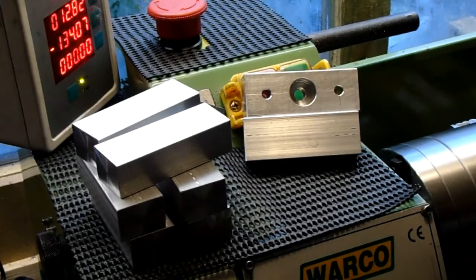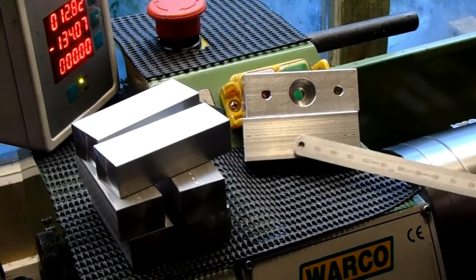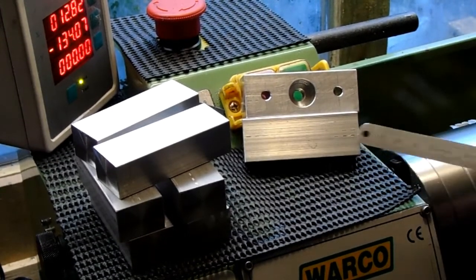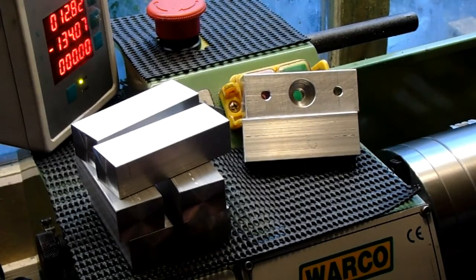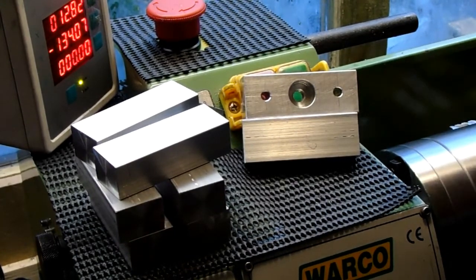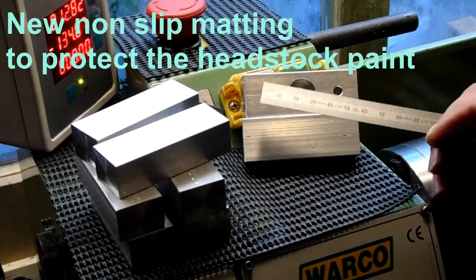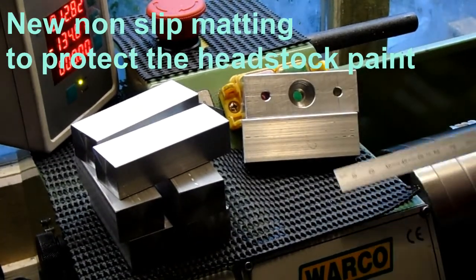Okay, so that's 20 of them done. All of them machined on both ends. 69.9 to 70.1 millimeter, something like that, on the overall length. So considering the ends are just in fresh air, it's within 0.1 tolerance, when it could be quarter of an inch. It could be 6 mil in variation length, but nice to have them all the same, somewhere to start from. So next job is to put in the three holes.